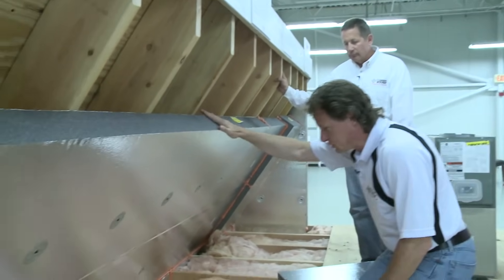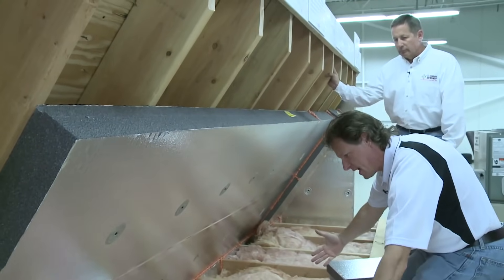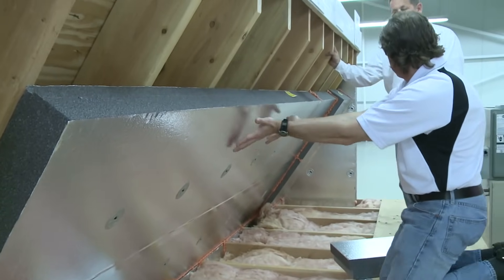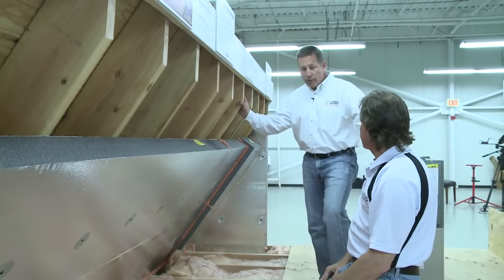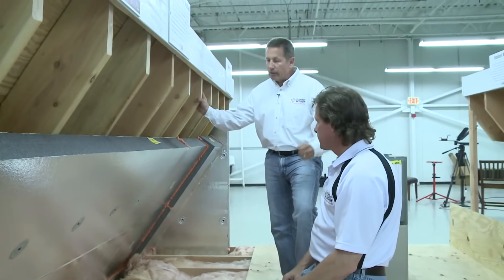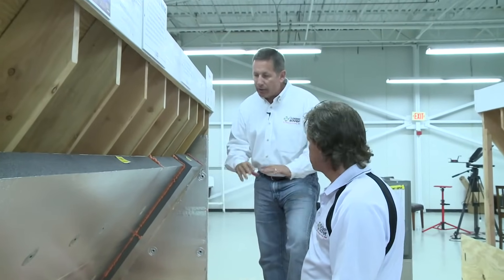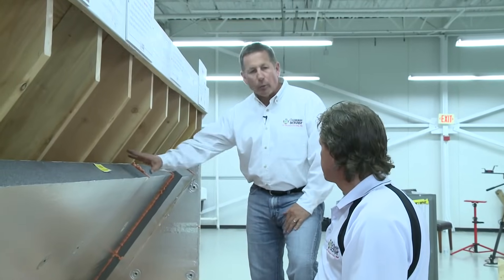But this approach takes this thermal boundary — we don't need this insulation anymore — and it puts the thermal boundary at the bottom of the roof. So if you wanted to store something in the attic, or if you had ductwork or HVAC equipment, it's really important to protect that equipment against air leaks and so forth. This would be the way to do it: just make the attic as conditioned, or as close to it, as the rooms below, and we can take that worry away.